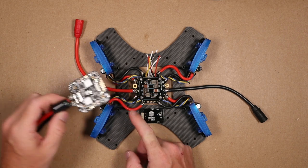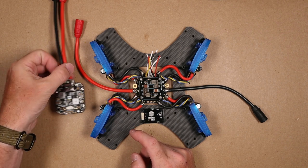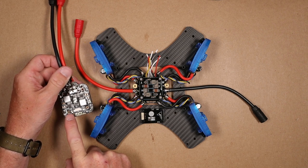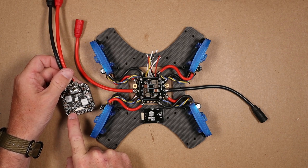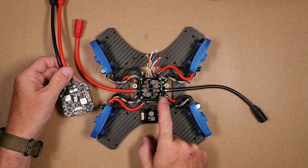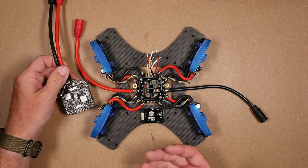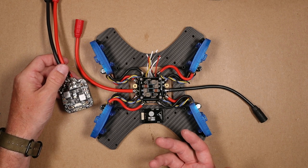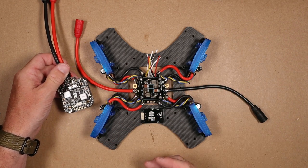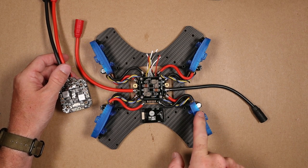There were a couple of reasons why I originally went with the Matek. The first being that it had a half-voltage pad, which would have allowed me to place a VBat wire on it and halve the voltage sent to the flight controller, so I could read the full voltage off the batteries. These flight controllers can't handle 12S voltage — some of them can only handle 6S. Well, this new PDB doesn't have that feature, so I'm going to show you how to get around that using Smart Port telemetry off the ESCs.